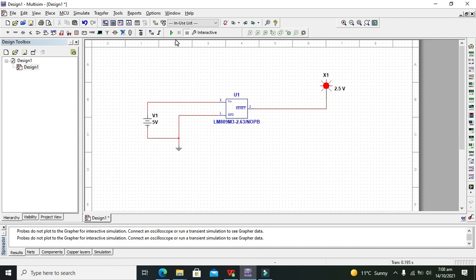So from 1.1V to 2.62V, it does not blink. But when the voltage is higher than 2.62V, it blinks. So our voltage must be greater than 2.62 volts. Hopefully you got the concept of how we can use the voltage monitor or voltage sensor within Multisim. Thanks for visiting our channel!